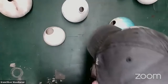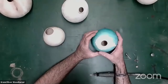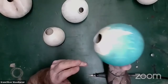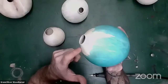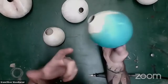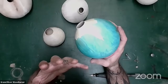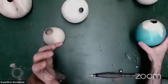We have a question. Yep. Hey, on the blue piece that you have there, did you bleach it before you put the dye on? Yes. It was bleached then dyed. 2 reasons. Definitely, knowing that after I had dyed it and carved it out, that wood underneath would be lighter, but also for the simple fact that bleaching, you know, this is box elder, so it's light to begin with, but it pretty much turns white. I know that my dye will come out really vibrant if I bleach the piece beforehand and start with that white background. Right.